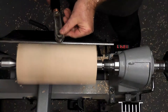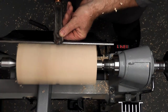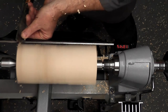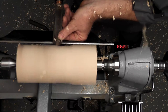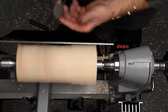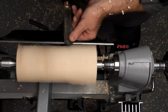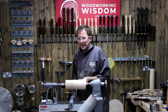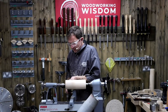Handle on the side of the tool, we're going to bring it on from the middle. Handle down low — gently bring it up. I've dropped the handle, bring it up, take a little bit off — find the bevel rubbing and where it's cutting. Now I shift my weight from my left foot to my right foot. If I don't take the tool off the tool rest, I haven't got to go back to reset. Knock the corners off a bit. I've positioned my body so I can start there, shift my body weight from right foot back to left. You see my body move a little bit — not walking, just shifting the weight.